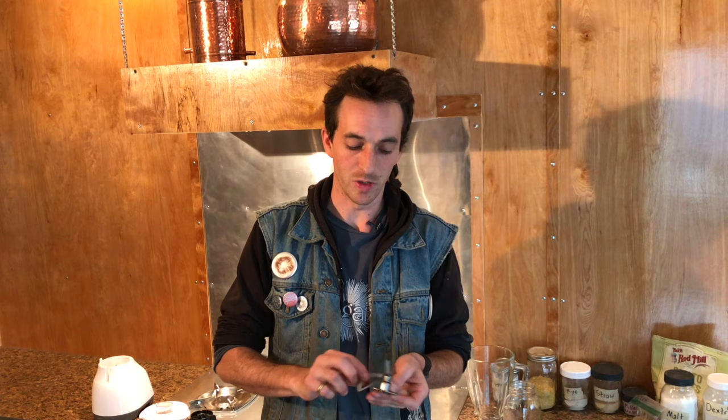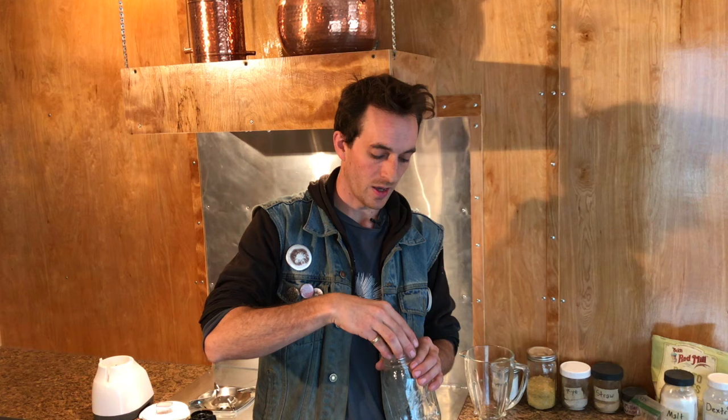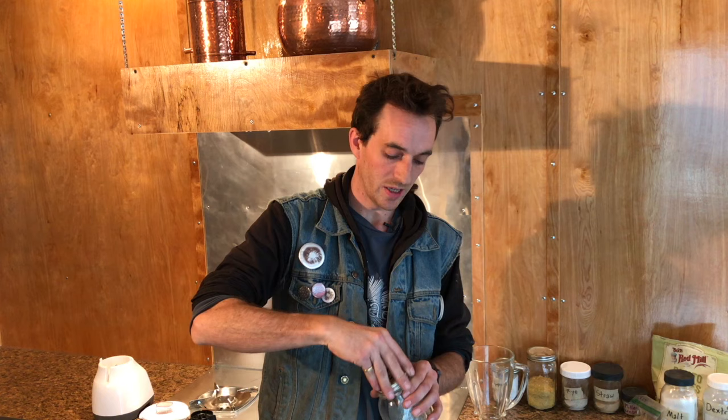This gasket will break down after four or five uses, so I like to use a silicone gasket instead. The other reason the Oster brand blender is the perfect choice is because it fits neatly over a regular mouth mason jar. These silicone gaskets are made for mason jar lids — you can get them nice and cheap — and you can use just a regular old canning jar lid to hold that in place. There you are: a $25 Eberbach stirrer.